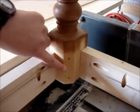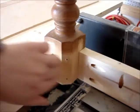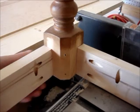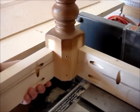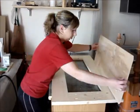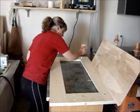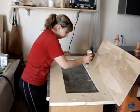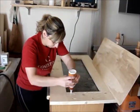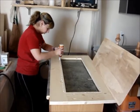This is the part showing how angled it is — these were legs based on the other table screwed in, but I screwed on the sides. So the piece of wood just had to have the corner knocked off so it doesn't touch at a 90 degree angle. Now that everything is lined up, I'm just going to put a little bead of glue all the way around. I'm using about half-inch staples — the glue is just there to stick and the staples are just to support it. You don't want too much glue because you don't want it oozing out.